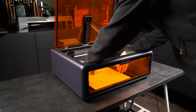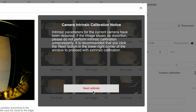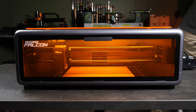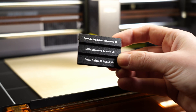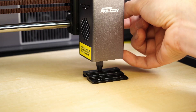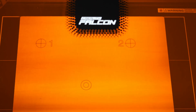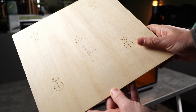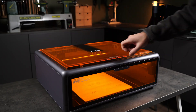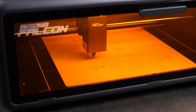Place the base wood sheet in the center of the work area — it doesn't need to be precise. Open the camera page in Falcon Design Space and click calibration. Since the machine comes pre-calibrated, you can skip the first step and click next. Then run the framing move to check that the base wood covers the entire engraving area. Set the laser height using the included gauge, then hit engrave. The machine engraves reference points for fine-tuning the camera. When finished, click grab photo, then double-click each of the four corner points in order and hit complete. To test, draw a cross on the test piece, take a new photo, draw a matching cross in the software on top of the image, set parameters, and hit engrave. The result looks good — maybe a couple of tenths of a millimeter off.